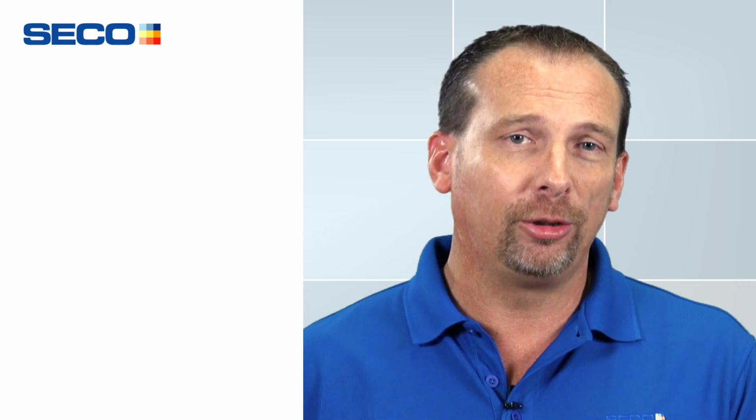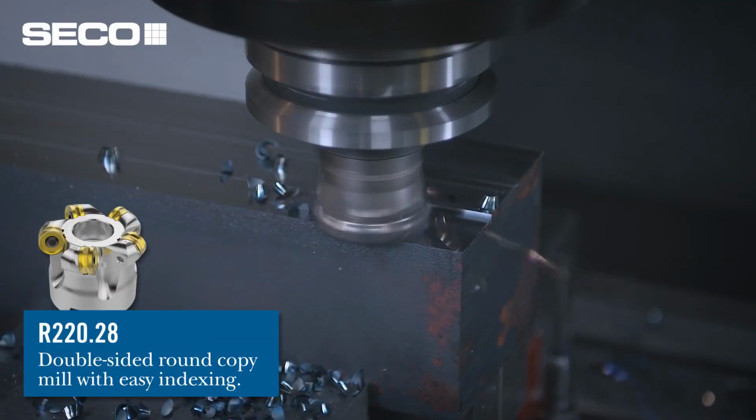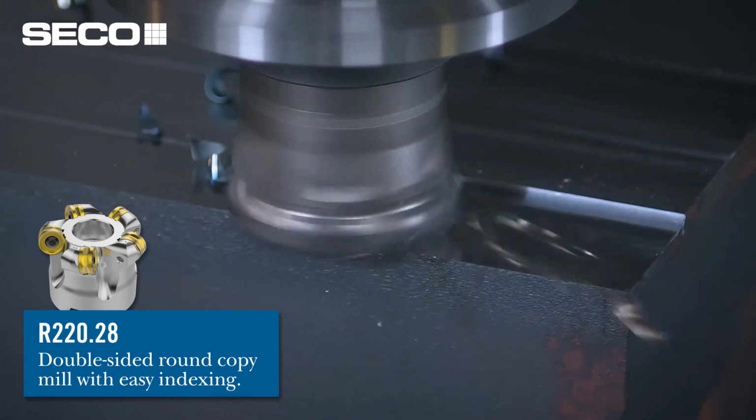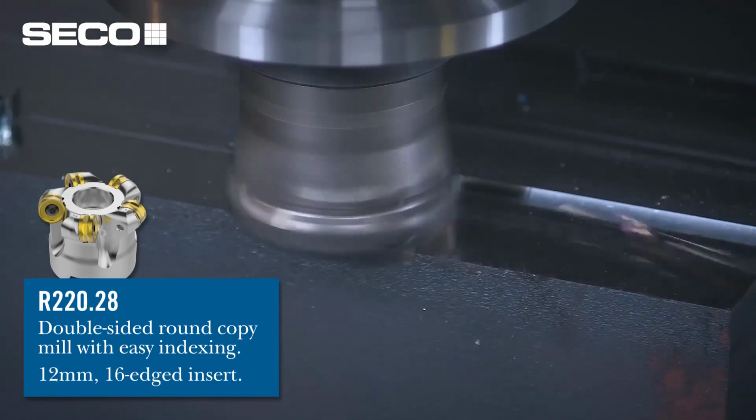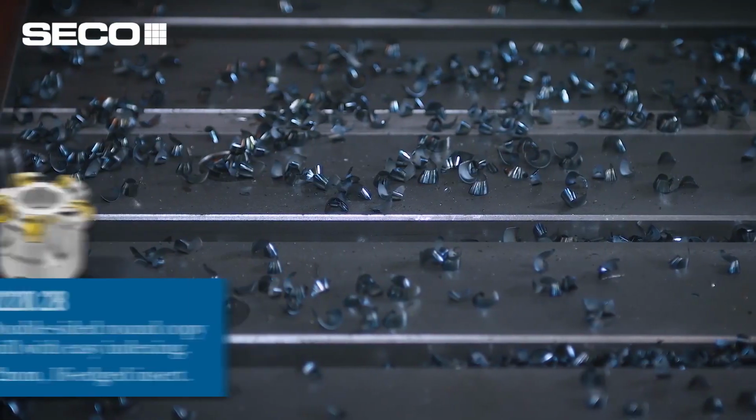We also have a brand new family being introduced. It's called the 22028. That's a double-sided round milling cutter for copy milling. That's going to be available in the 12 millimeter insert size. There's going to be different pitches available along with 2 different geometries and different grades for different materials.